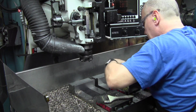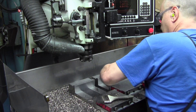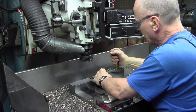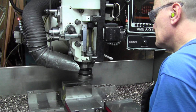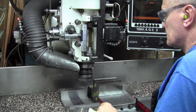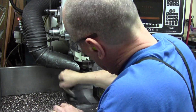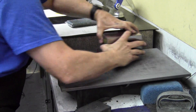We're going to pop it out, clean everything out. In this case we're not going to be using the weld wire because we've got two parallel machined faces to grip on. Grabbing it, tapping it down with the brass, making sure we're seated good. Going to our finished dimension and machining this face off. You may notice there was already a machined face — that's because I took two passes on this and just cut out the initial pass, saved some time. So there it is, finished on the four sides.